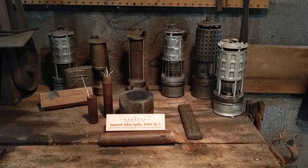To set our charge off back in that hole, if we just tamp the whole thing completely shut we wouldn't be able to get anything in there. So what they used was called a needle. A needle was a large brass or copper rod that would be inserted into the charge after it was placed in the hole and left there. The miner would take tamping material and pack the hole using his tamp rod, which had a notch that would fit over top of that needle. Once the hole was tamped, he would carefully withdraw the needle, leaving a path all the way back from the face to his black powder charge.